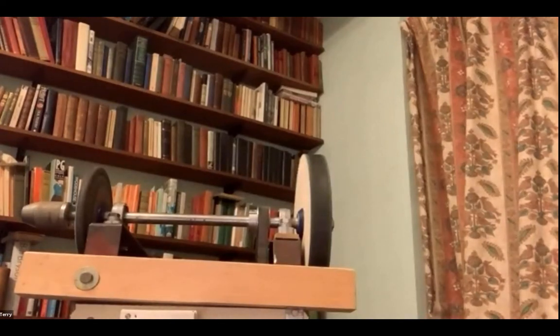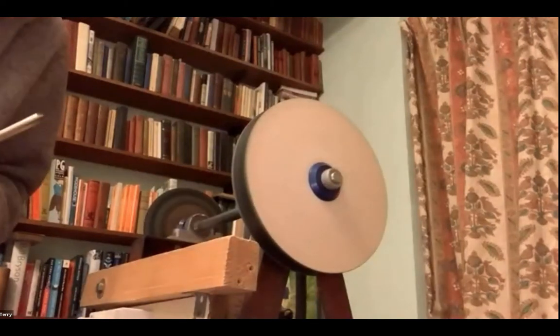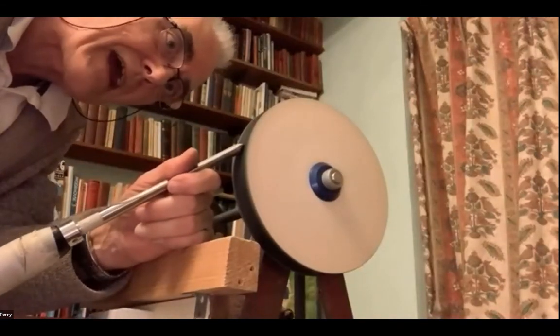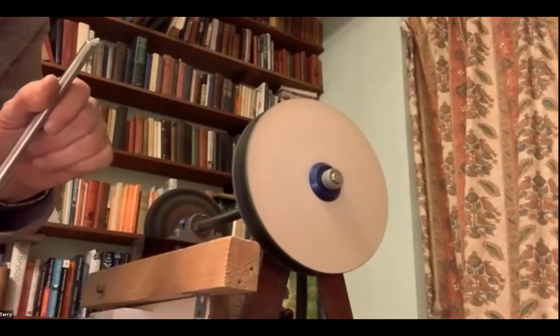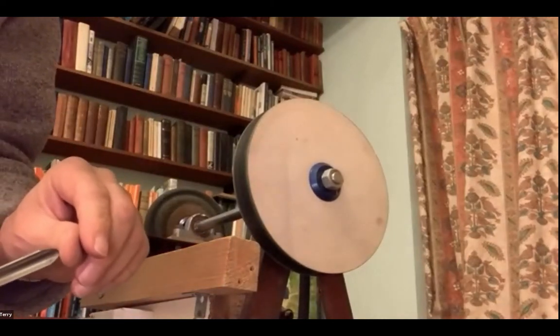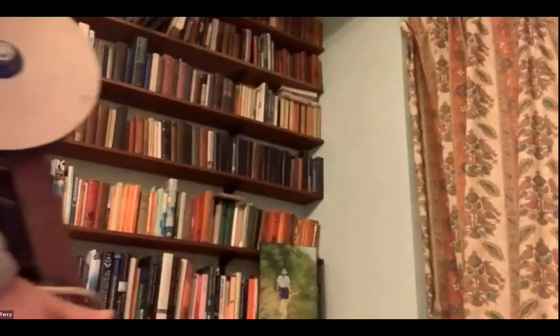Plug this thing in. Turn it around a bit. Okay, you see that, can't you? So it's running away from me now, and all I've got to do is by eye line up the gouge bevel on there and just roll it a bit. It's a bit like grinding the tool. Like that, and that will give you a polished bevel that will take your thumbnail off, not catching it. So really good edge. I should imagine it's as good as anything you'll get by other methods.